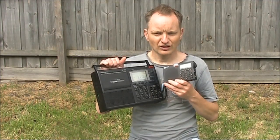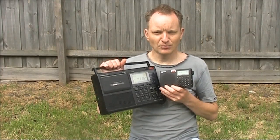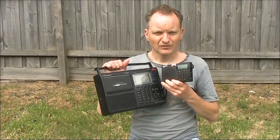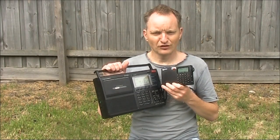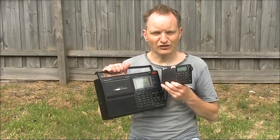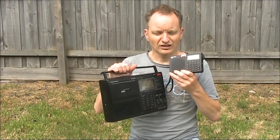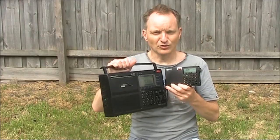The thing I didn't like about the Digitech was the tuning — it was rough, whereas after my modification it was super smooth on the Realistic. Another thing is that with the Digitech, I found it draws a little bit of current when it's switched off, so when I'm not using the receiver I have to put a bit of paper in the battery holder to keep the battery separate. Another consideration of course is size and weight — the Digitech is far lighter than the Realistic, which is worth considering if you're taking a portable.